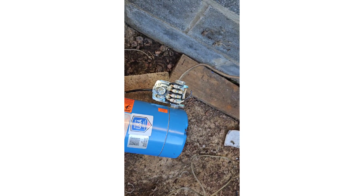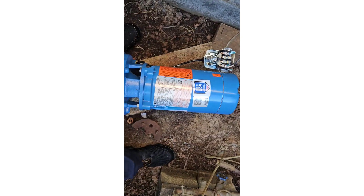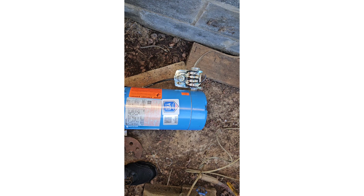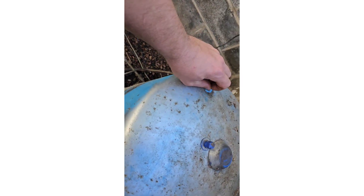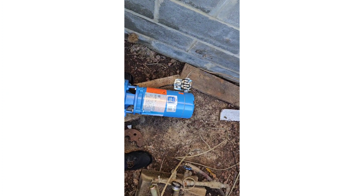I'm going to get this apart, set the wire aside, pull the pump out, disassemble everything, and put it back in the box to return to the supply store. I pumped this up to 28 PSI yesterday — it's a 30/50 switch — and we're still holding air, so the bladder is probably fine, but I'll likely swap it out anyway. It runs half-inch all the way up.